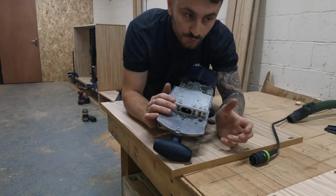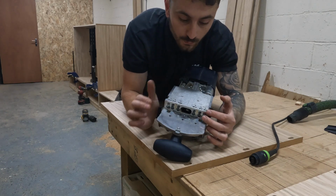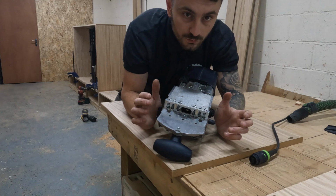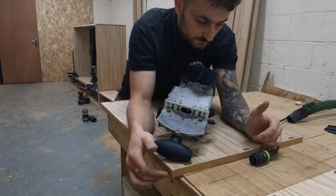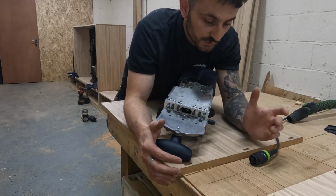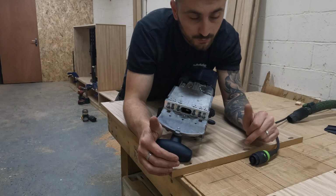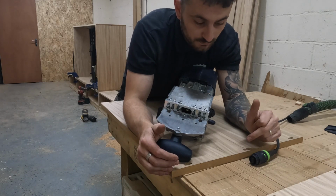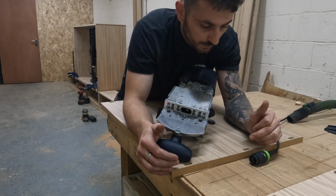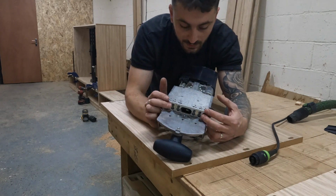And now when we come to do the uprights, we've then got that exact reference face that we can mirror for each slot. Then for the centre, we're just coming 250mm, which is obviously the centre of the units. 250mm, marking that, that's the centre of our third and final domino for each of these pieces, all right? So like I said, there's three before. That's how we mark it out. That's how we gauge it.